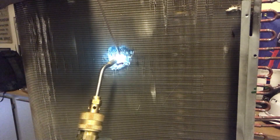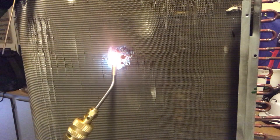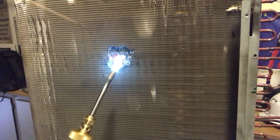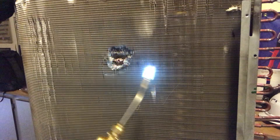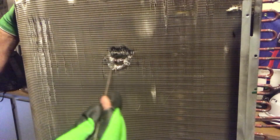The length of the copper tube is absorbing the heat. We're going to get the silver solder wrapped around here — it doesn't look that pretty, but the key is to really get that silver solder in there. Using a little more silver solder and we're good to go. The coil is just absorbing that heat, so you have to know that going in. We've got the silver solder in there — there's a little bit of a drip, but the big thing is we got that leak fixed.